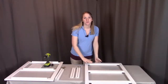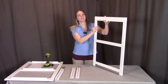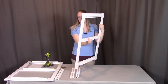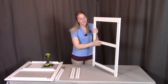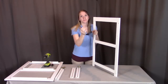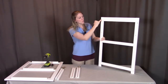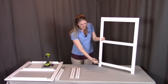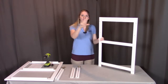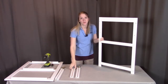For this step, we're going to be putting the front rails onto one of the center frames. I'm going to start with the right center frame. When looking at the center frame, one side will have ledges, which goes to the outside. The flat side goes to the inside, where the front rails and rear rails will connect. One hole goes all the way through for the bolt, and the second hole is where a peg goes to help secure the front rail in place.